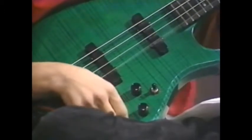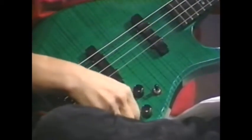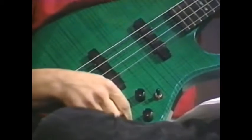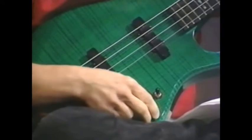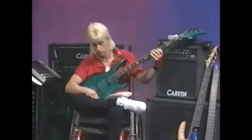Same thing with the treble control. That adds treble, and this cuts treble. And as you can see, there's quite a difference. Once again, leave it right in the middle. Personally, I'll boost normally a little bit of each, but if you turn both of them all the way up, you're going to get a certain amount of distortion. So there you have that.